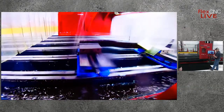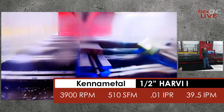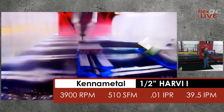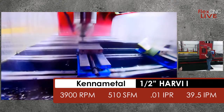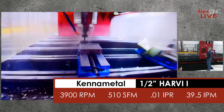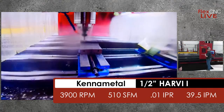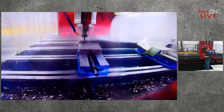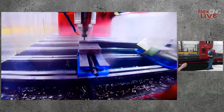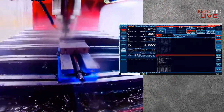and then we'll bring the chamfer mill out. It's just a 1-inch indexable chamfer mill. It can be used as a spot drill. Now you notice I didn't spot drill any of these holes. I'm using good carbide solid drills. So what I can use that chamfer or spot drill for is after the hole is drilled, I can just come down on top of the hole, give it a nice kiss, leave a good chamfer, and get those burrs off of the holes.